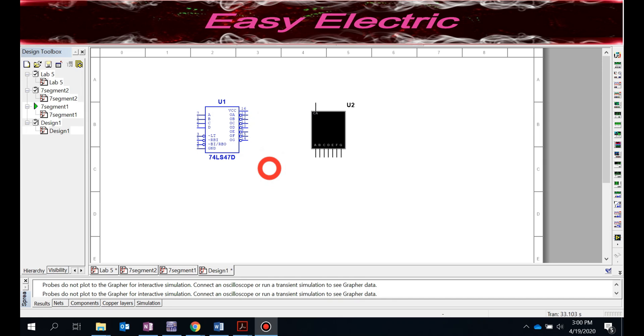Looking at the seven-segment codes from the previous video, you need to take the NOT of all of them — active means zero, inactive means one. For this reason, the seven-segment display you use should be a common anode type, shown here as 'CA'. Common anode means all seven LEDs inside are connected together at the anode, and that point is connected to VCC. Whenever you put a zero on any segment pin, the corresponding LED turns on.